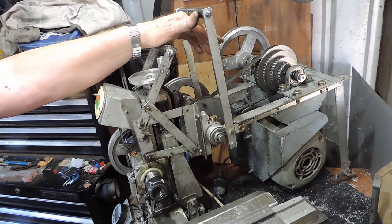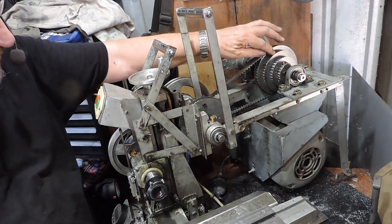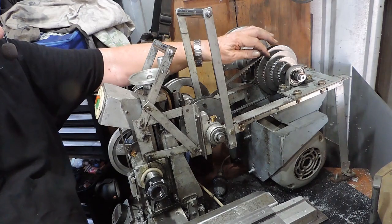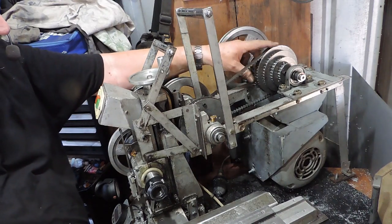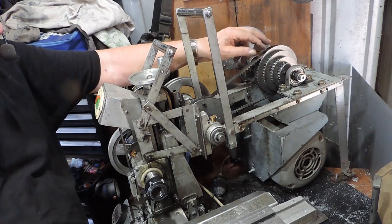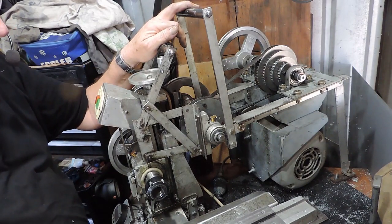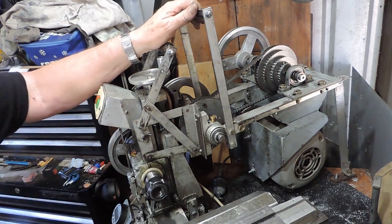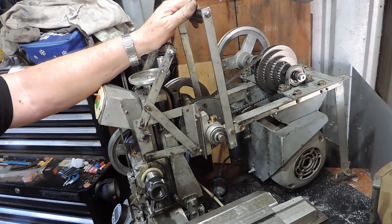4,000 RPM is pretty high — I don't need it. During this exercise of making these pulleys I was using the 2, 3, 4 stages while cutting the original 5 inch pulleys and the remade 5 inch pulleys — I think I had three goes at it. I just won't use high range 4th gear, or 4th speed high range. So that's it for me on this particular job.